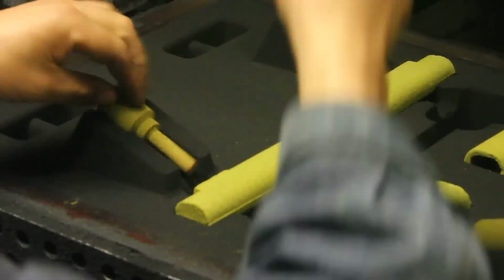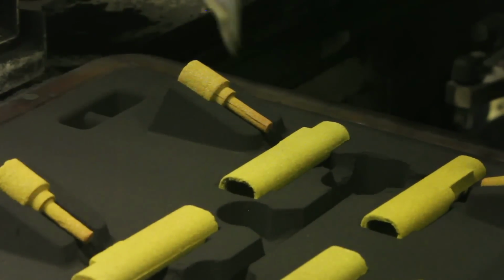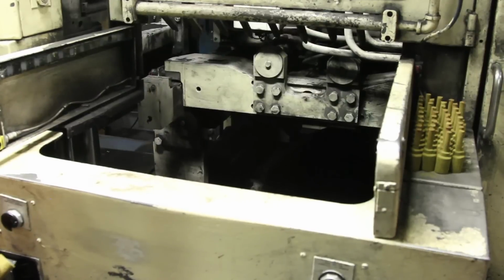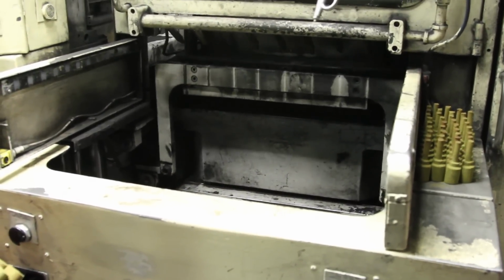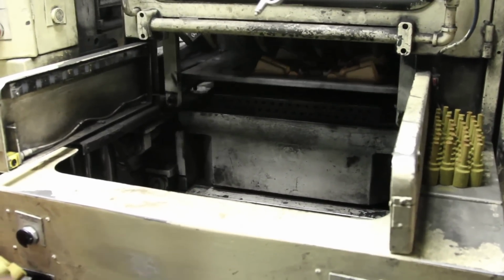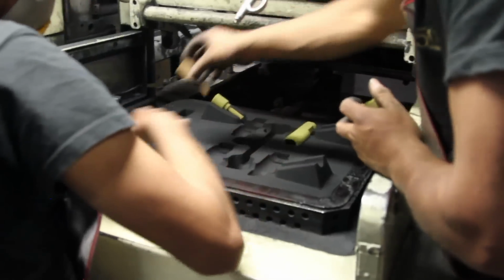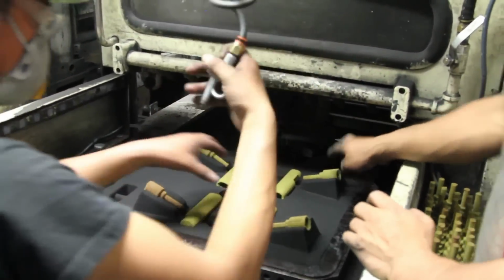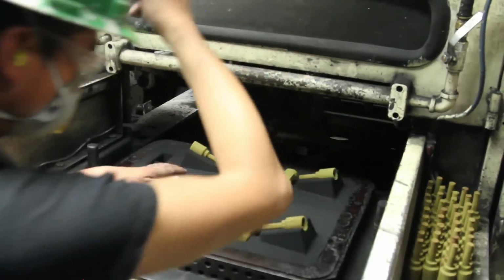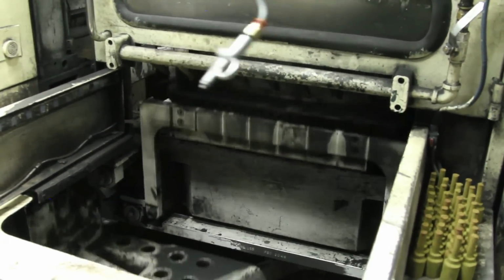If our final product has cavities or holes, the cores are placed in the shape of these. This equipment also produces parts that require no core. Once the cores are placed, if the part requires it, the mold is blown and inspected to remove small particles of loose sand and to verify that the print is a faithful replica of the model plate. The mold is closed and transported to the pouring and cooling carousel automatically.